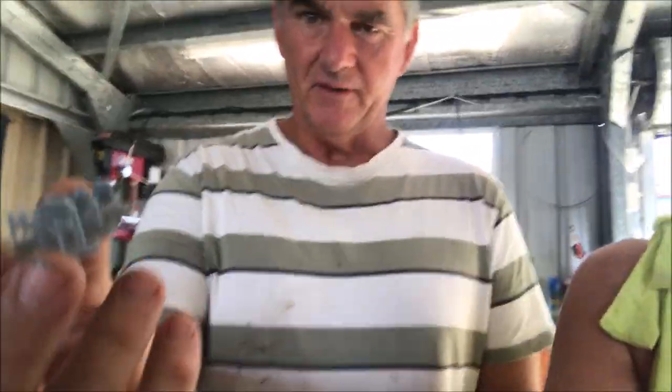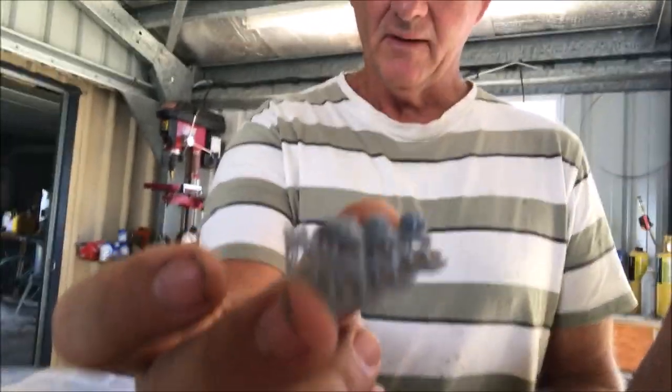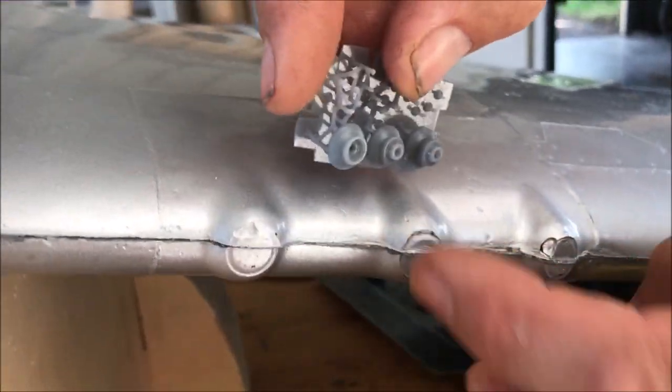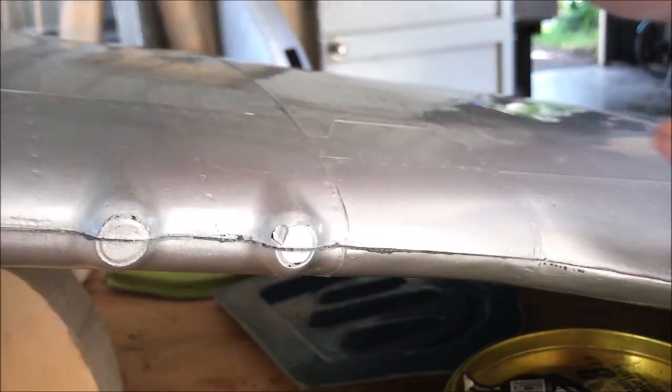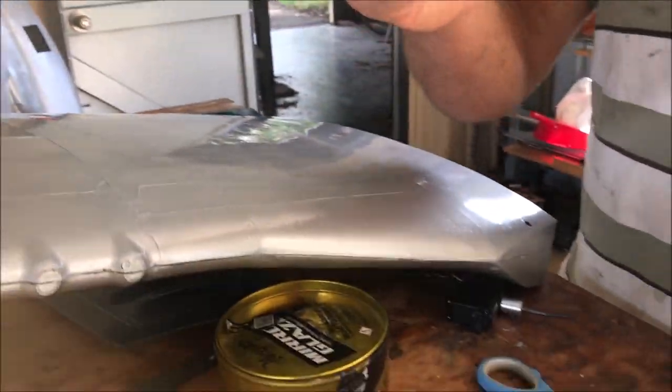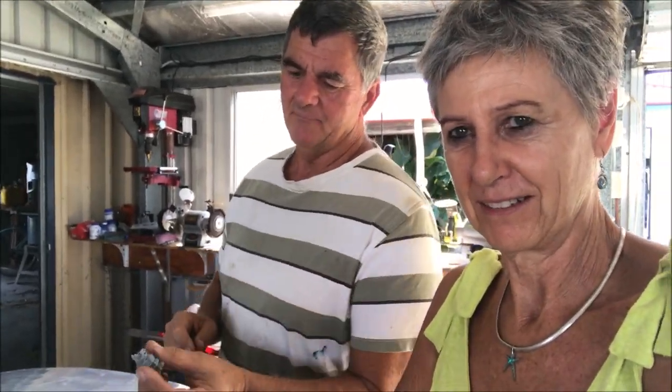A little bit of bling — the Mustang has gun ports, so we've been printing them on the SLA 3D printer. They get inset into the fairing in the wing. It's worked alright but we want to bling it up a bit since it's Patsy's plane. We made a set for the Corsair a year or two ago out of aluminium on the mill, brightly polished — they looked awesome, really schmick. So we're going to try and do the same on this: make a set of polished aluminium gun ports for a special plane.